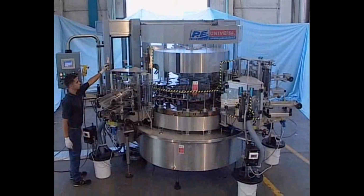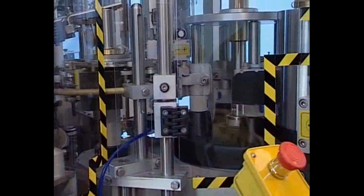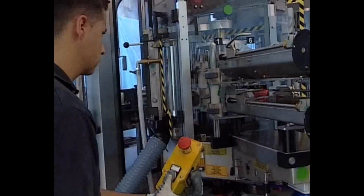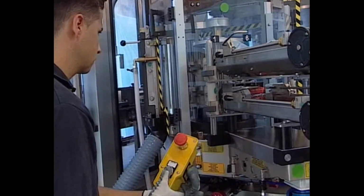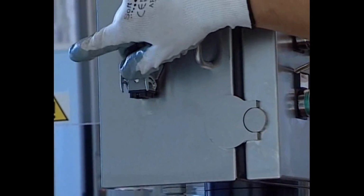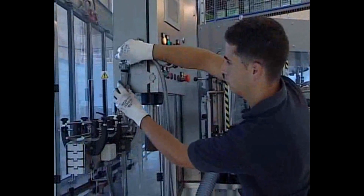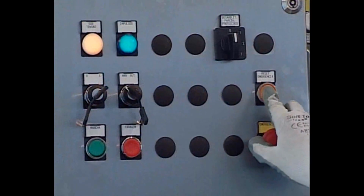Now that we have finished installing the equipment on the machine and units, let's lower the safety panels with the lever, and the system can now be started back again at manual speed. At this point, the operator can verify close-up if everything was installed correctly. Now the machine can enter production at the speed that is regulated automatically according to the flow of containers on the line.